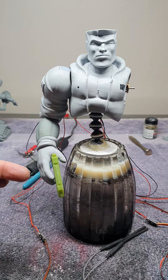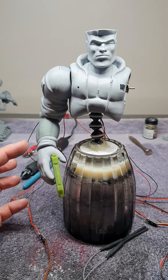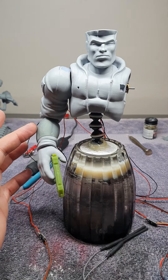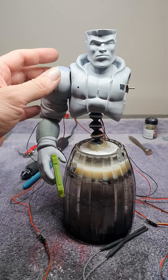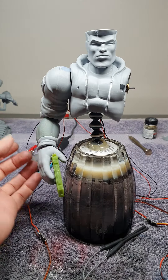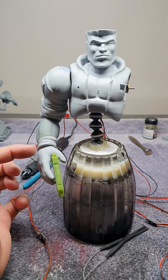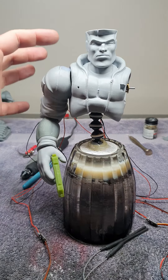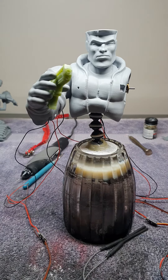Printing the gun out gives me a bit more of an idea of the weight of the arm, especially when it's extended all the way out. I definitely have to hollow the hand. I can't hollow the forearm because it's containing the motor, so there's no point in hollowing it — this is actually partly hollowed. I think my best bet is to hollow the hand out first to reduce some weight. If that doesn't work, I'm gonna have to upgrade the motor. I think I have 30 RPM; if I can drop that down to 15, it'll be a little bit slower but a lot more grunt.